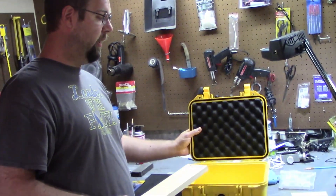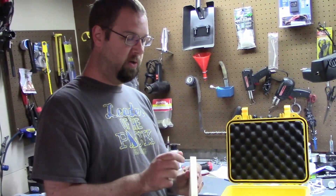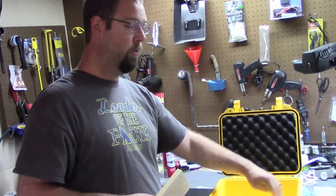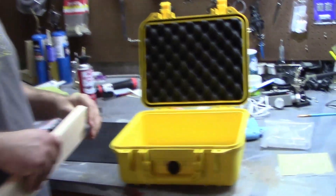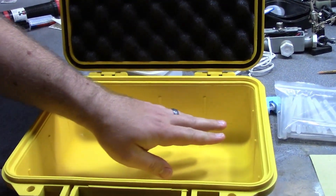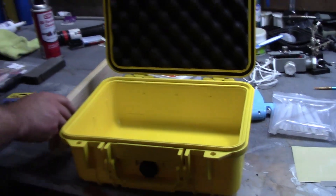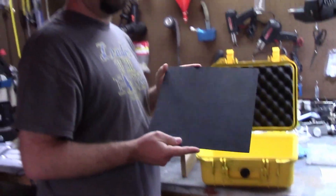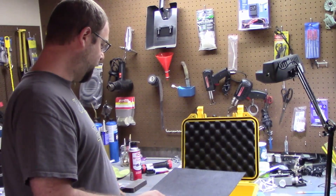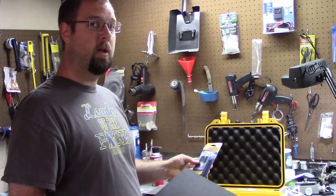As we mentioned, I've got a scrap piece of pine wood with a nice flat surface. What I'm gonna do is cut it into small chunks so I can make a flat surface around the inside of the Pelican case. We're gonna use these little nubs to make a little shelf, and put pieces of pine in between some of these to create a flat surface to place our sheet of ABS, which will be cut down to size and rest on top. We'll be attaching it using velcro strips so we can get in and out easily.